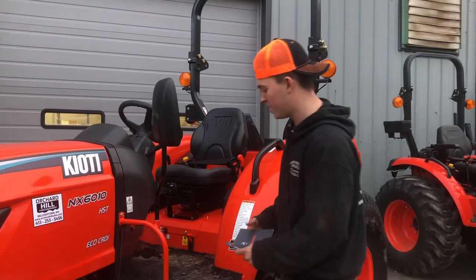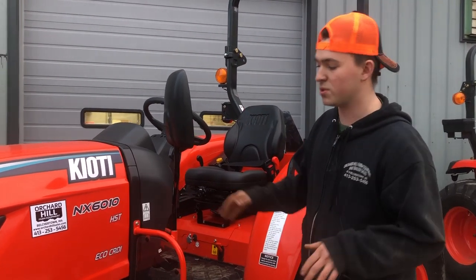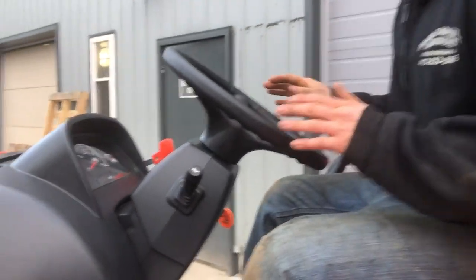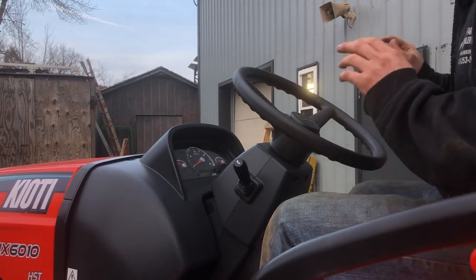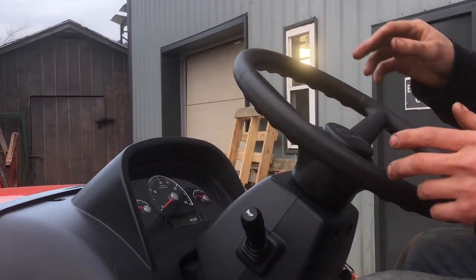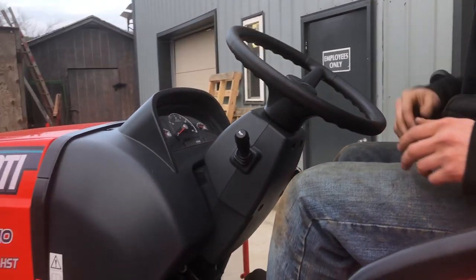If it flashes twice, there's almost no going back from that. If you don't need to use the machine when that light first flashes or when it flashes twice, you can do a parked regen. If you want, you can just rev it up and use the machine, and I bet the thermometer and puff of smoke light will probably come on and you can keep using it like that.